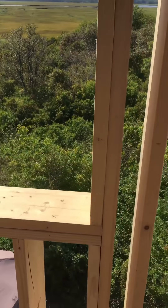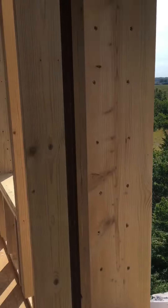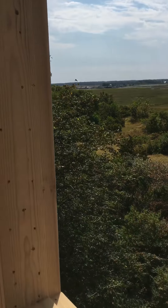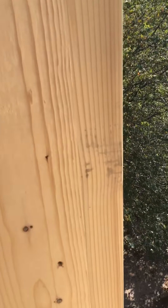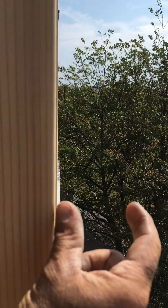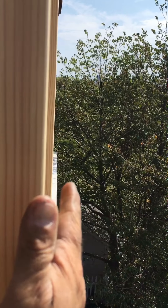We're almost done — I framed these windows in. So there's a little extra detail on the wall because we insulate the 2x10 full, and this just gets drywall. But on the outside, we get this offset step because we've got two inches of rigid insulation.